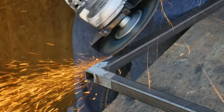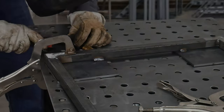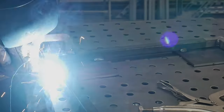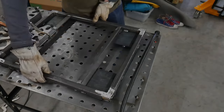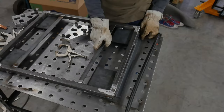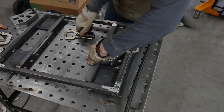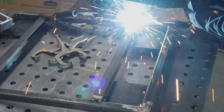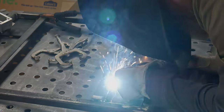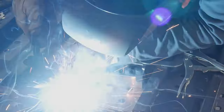Once the frame is flush, we'll lay it down on the 5-inch by 6-inch quarter-inch mounting plates. If you are planning to use bolts on your casters, I'd advise drilling the holes ahead of time. However, in my case I was on a time crunch and decided to weld on the casters. After all four mounting plates were welded to the frame, I started adding the 3/16ths-inch thick angle iron supports. These angle iron supports add rigidity to the entire assembly, support the mounting plates, and also provide mounting points for the plywood later in the build. I used my Fireball Minion Squares to space out the angle iron braces — this is one of those situations where prior planning really helps speed up your work.